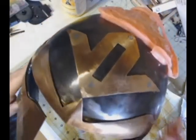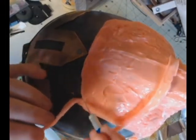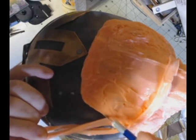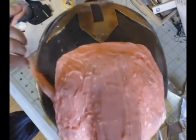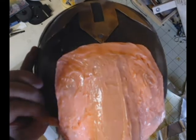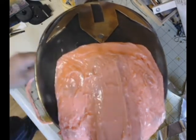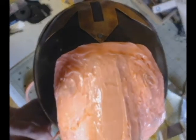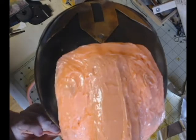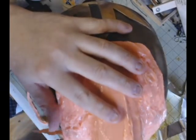This is the first cut I'm doing here. We'll cut a little more off, but I'm not being super detailed about it at the moment. I'm just trying to get that off. There's a few little areas here I'm just trimming, but I just want to get that lip off, and then I'll go back and make sure that it's a nice straight edge, and that it complements the rest of the mold. Now, you don't have to be that detailed about it, but I would suggest that you definitely take your time and be patient with it and make those edges nice, because you've got to do the mother mold. The Plasti-Paste we're going to use for the mother mold has to cover those edges. So you want to make sure that you make those edges as nice and flat and pretty as possible.